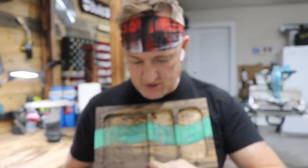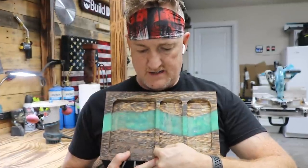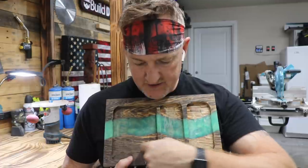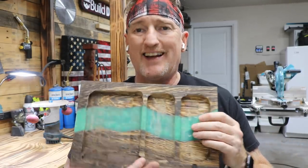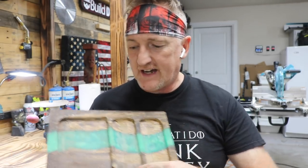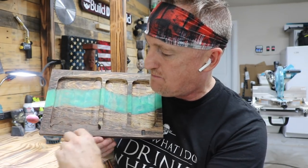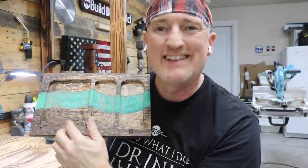What I'm going to end up doing is bringing this compartment all the way over. I think the wenge will handle it, but I have a feeling once I get to the epoxy, that's just going to blow out anyway. So we're just going to take this center section out, make this one big place and this a separate deal. It'll still function the same way — sometimes you gotta roll with the punches. I hate jigs, I hate making jigs, but in order to maintain a good guideline now that I'm so far down here, I'm going to have to build some sort of jig to run the router straight across and make sure it doesn't pull me out of straight.